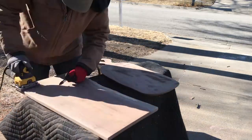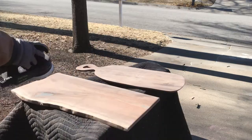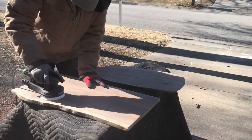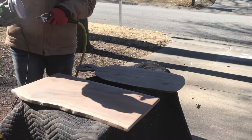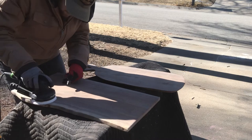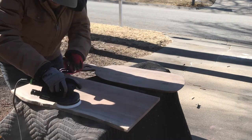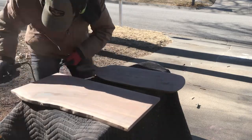You can see I'm using the air compressor, and that is a huge hot tip. If you're trying to get rid of swirl marks while sanding, the air compressor helps a ton — it keeps dust from gathering on the sanding pad and keeps it off the wood as well. I spray it consistently. It's especially helpful when sanding epoxy because it's tough to get that epoxy looking perfect. I'm finishing here with 220 grit.